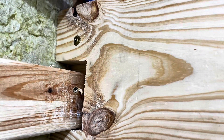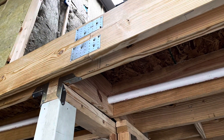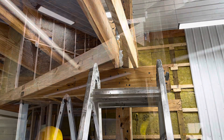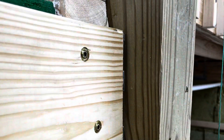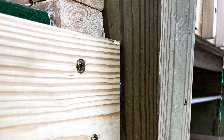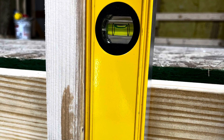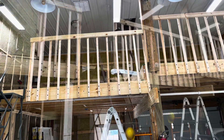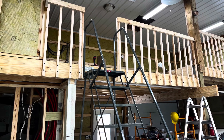There's that board up and in place, and you can see where the notch is — it worked well, it's going to hold the weight and be nice. You can see where it's attached, with the board stretcher holding all that in place. Then I went ahead and locked it in on the other end — threw on the balusters, threw on the top rail just like I'd done on the first side. Used the same leveling technique to get perfectly vertical balusters. There's the balusters in place, there's the top rail in place.